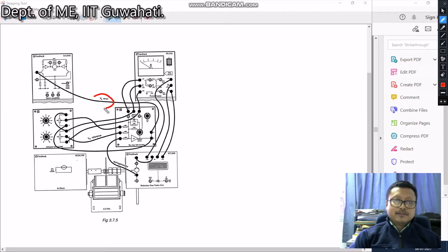I want to show the data you need to collect. For error voltage, put the multimeter probe here, common voltage probe here, and positive voltage probe here — then you can get the error voltage. Reference voltage you can get from this attenuator unit by putting the power terminal of your multimeter on this board. For tachogenerator voltage, put the multimeter probe here. Also, you can measure by switching this knob, and on this display monitor you can measure both tachogenerator voltage and RPM by switching this lever — if left, it shows voltage; if right, it shows RPM of the revolving shaft.